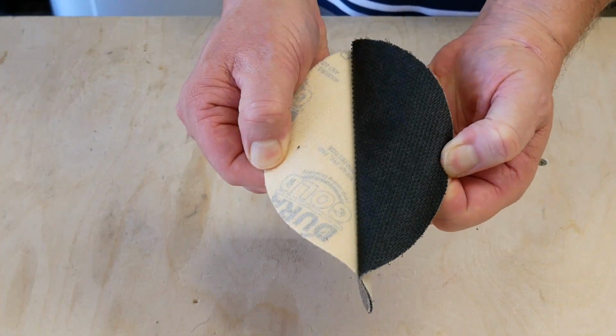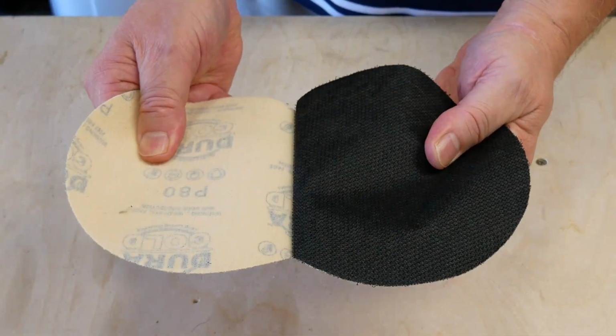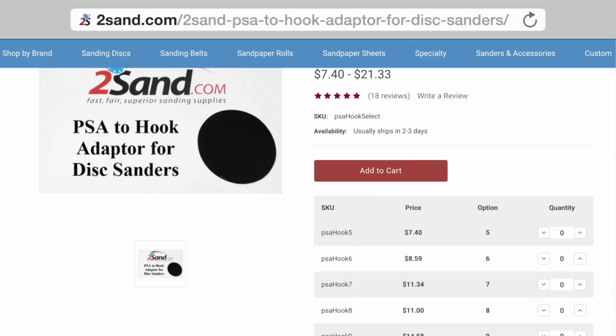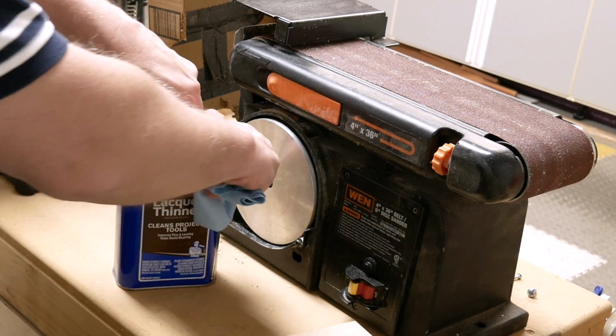Discs that use hook and loops, often called Velcro, but that's a brand name, are simple to put on and take off. The trick is to get one of these PSA to hook adapters from tosand.com. They're not a sponsor, by the way, and you may be able to find similar adapters elsewhere. In any case, they're pretty inexpensive. Just pick your platen size. Make sure your platen is nice and clean.